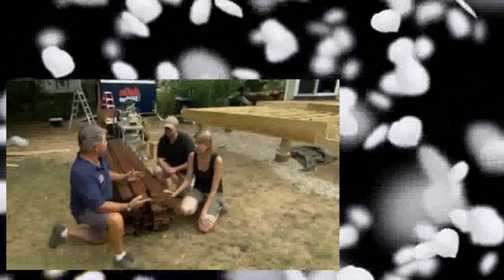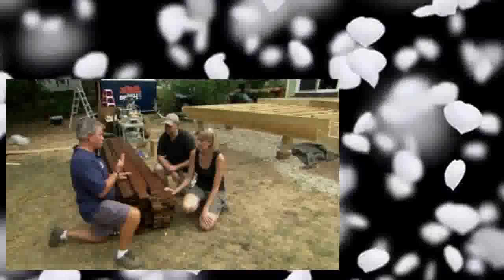But you guys wanted to have it stained. Yeah, we decided that we liked the look of the darker, richer stain. And it is very rich. So what we did, we had the factory stain it. The benefit to that is they stain all the way around the board. If we were to do that in the field, it's a lot of work. Now your deck is going to be 20 by 20. That's about 400 square feet. So we ordered 450 square feet for waste.